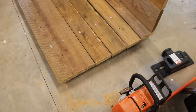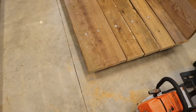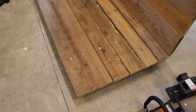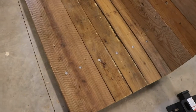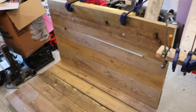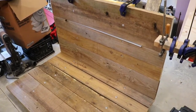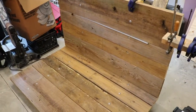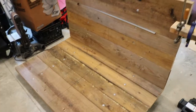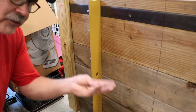Okay, so my dimensions are different. And then on the bottom, I had a 2x6, 2x6, 2x6, 2x6, and a 2x12. And that lets it hang over about an inch. Right now it's 53 inches wide, but I'm going to be putting on sides and so forth. So it looks like it's going to meet my needs. It looks good. Big enough for me, I think. Stay tuned. 3-inch deck screws.